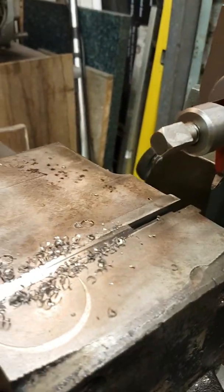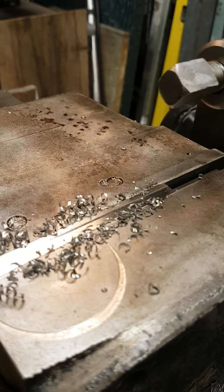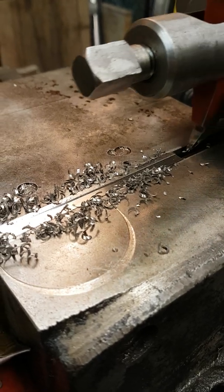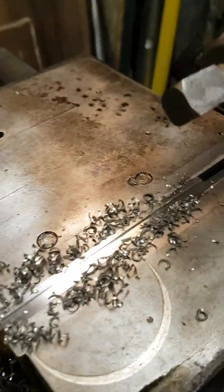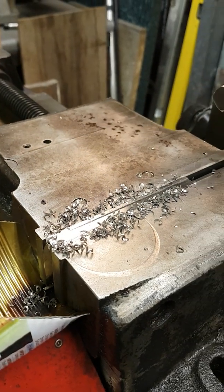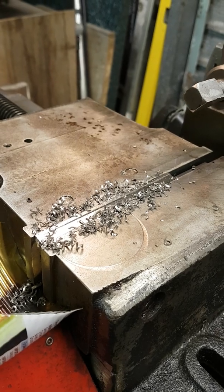So it turns out this stuff is quite a handful. I've got a big char mark in the bottom of the can - I guess you can tell what happened there. But it is actually machining beautifully and there was no sign of any ignition so I thought I'd increase the speed a little bit, and yeah, it all went up. So I'm just taking very very very gentle cuts very slowly at the moment, but it's leaving a beautiful finish which is nice. I'll let this carry on and see what ends up in the can.